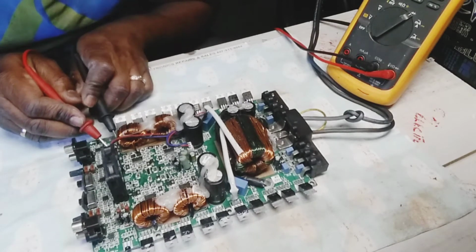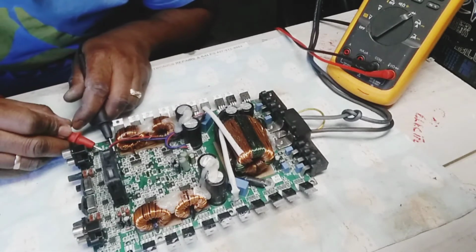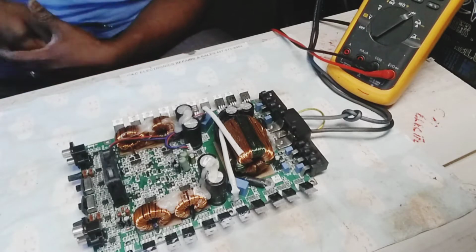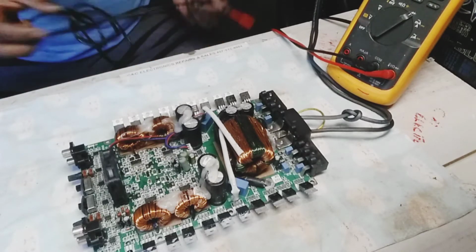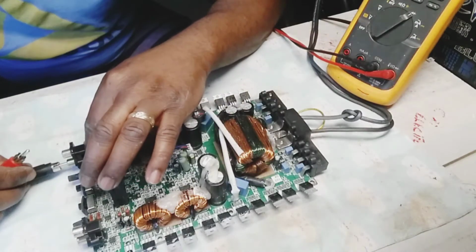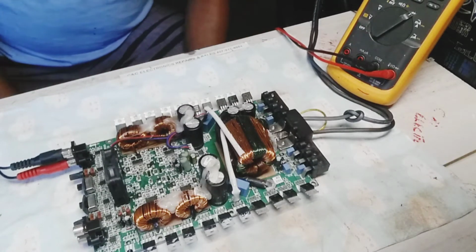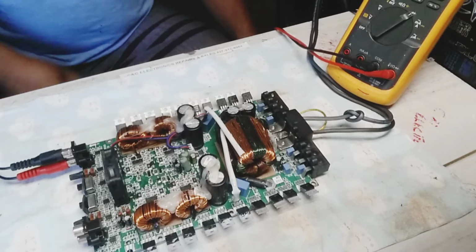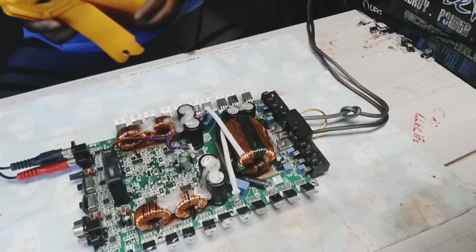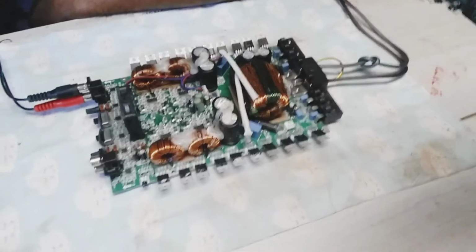And I have a diode here going like crazy. Can you imagine? See it? And it starts reading good. So alright, let me get an RCA jack here and see if everything is okay with this thing. So this should be this side, that should be that side. Alright, let's see. I'll put that side in real quick. With these guys, I say you have to check twice with this stuff. It will mess you up. And these parts for these amplifiers sometimes are really expensive.